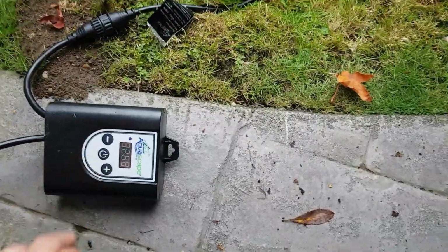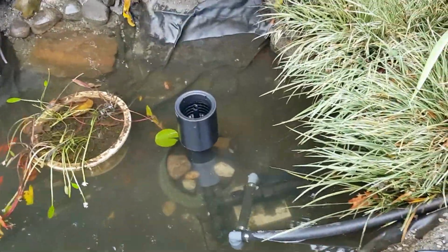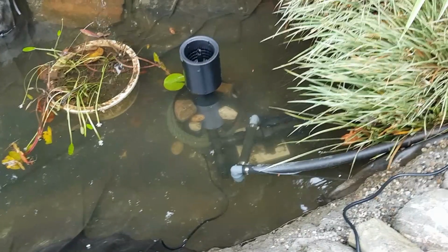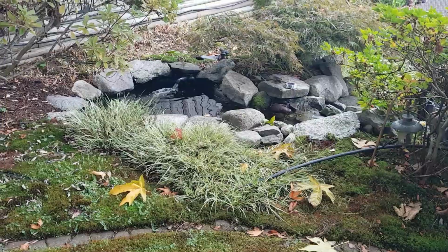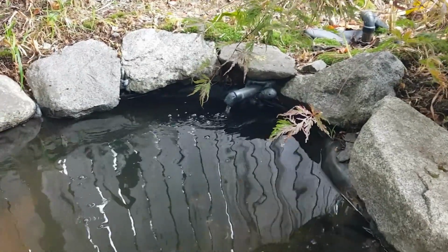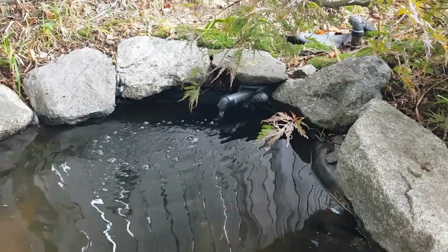And we'll turn this thing on and see what happens. There you go, level one. So, of course, it's pulling air because a pump will draw whatever's easier. But the pump is flooded for sure. So it's not running dry. That we know. So let's just pause and go up to the. Oh, you can hear it drinking a little bit. Let's go up to the upper pond here. Okay. Here's the upper pond. Fish down there. Okay, there's proof right there. So we do have pump protection with that little deal I made up. So that's good, because that little bit of water, that's gonna keep the cartridge lubricated and not burn out any seals. So that's good. And that's on level one.